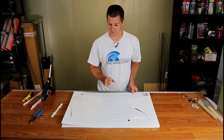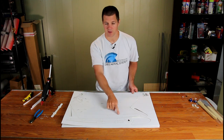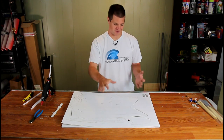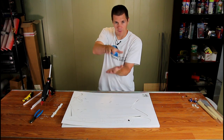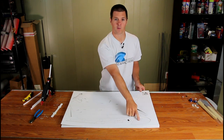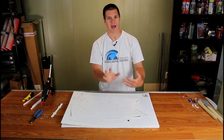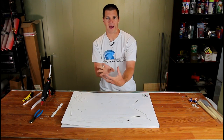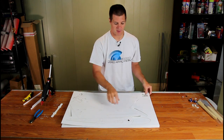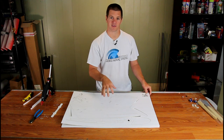There are two or three other parts that aren't so obvious. A thin strip goes underneath where the elevon goes because you don't want a goofy airfoil from bringing two pieces of foam board together — it's just a spacer. There's also a winglet, a front piece that goes in the battery door area acting as the front of your battery and electronics bay, and a servo support that installs under the wing.